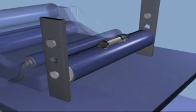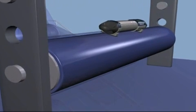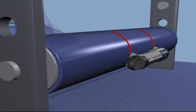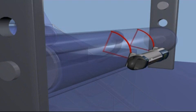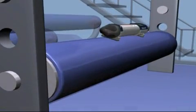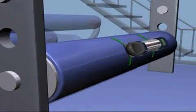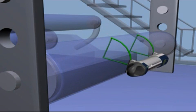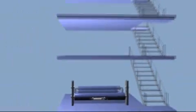How does it work? During the rotation over the first roll, its relative position in space is determined. The next roll is measured with a further rotation. The deviation of the roll position is determined in a matter of seconds, and the relative offset to the first roll is displayed immediately.